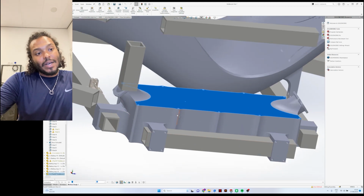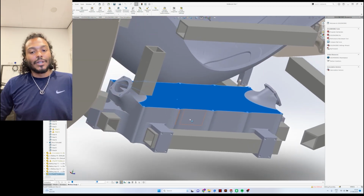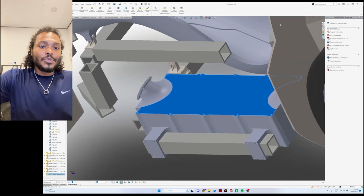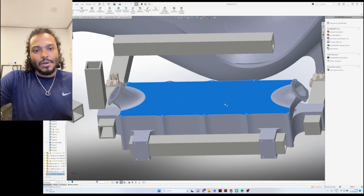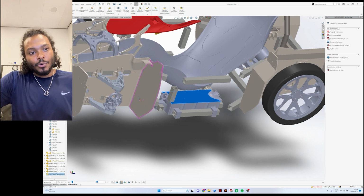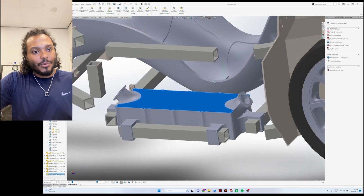And then in this box here, I don't think that the batteries will need a tremendous amount of cooling, but I did want to make something that would have continuous air circulation in it. So even though it's not a radiator or liquid cooled or anything, we just maintain a proper airflow over all of the batteries. So we have an air intake that will be placed within the wheel well right here. And then we can place a fan on the exit right here, and then we have continuous airflow going through this battery box.